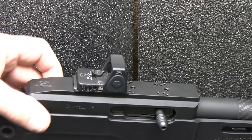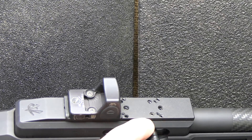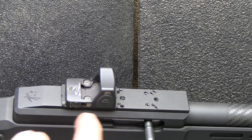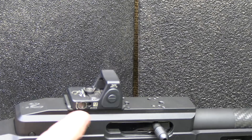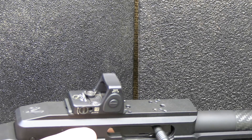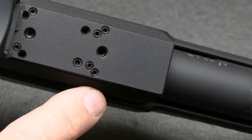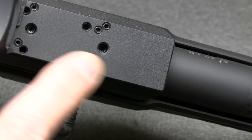The upper receiver is all aluminum. One of the beautiful things — and something I think is really a game changer — is they have drilled and tapped every major footprint for any micro red dot you've got. So you don't have to have adapter plates. It's milled in at three different positions so you can put that red dot wherever you want. Here with the Trijicon RMR, it's in the perfect position, as low to the receiver as possible. There are set screws in each one — just take it out, place your red dot on, and screw it right in. It is so simple, and it's really stable with the receiver.